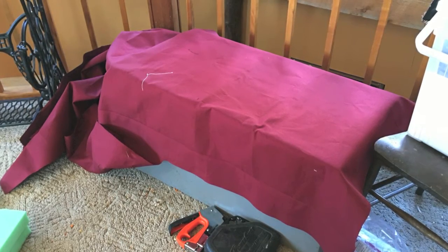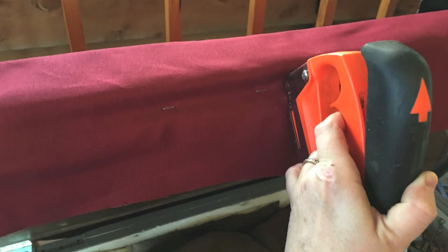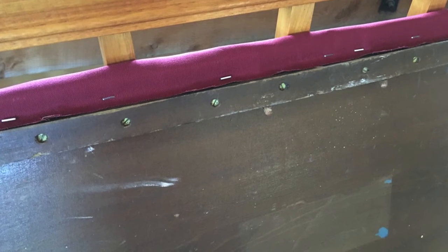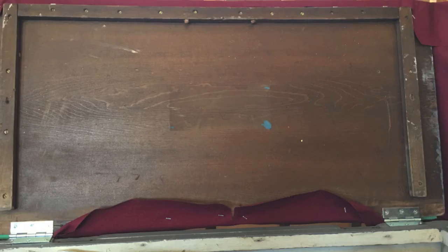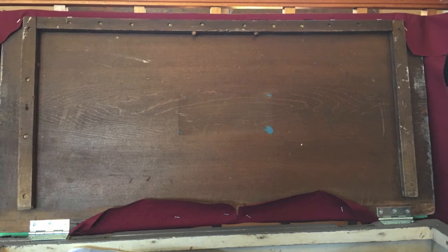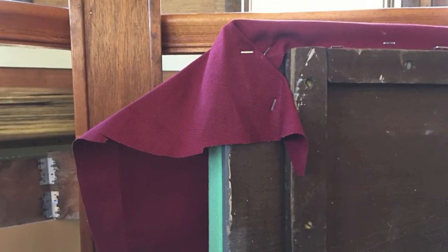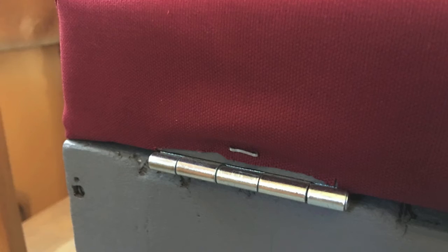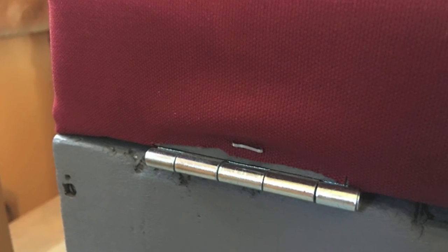The first thing I did was drape the material over the box, cut it to where I wanted it to fit, and then I stapled it onto the box. After I got enough staples into the edging I trimmed it off, then I started wrapping the bottom part underneath and stapled that on. I worked around the box making the corners really nice and snug, throwing in enough staples to make it fit. At the end I threw a staple in by the hinges and trimmed around it to make it nice and neat.